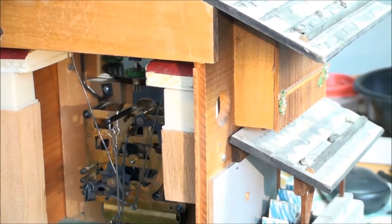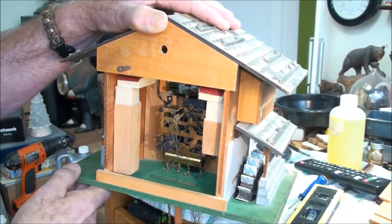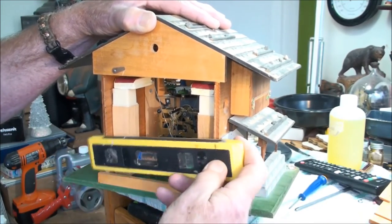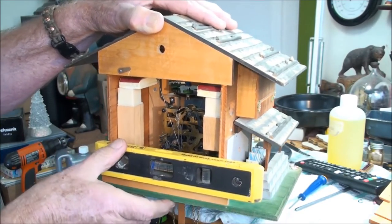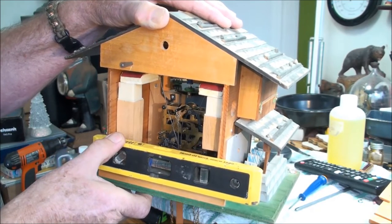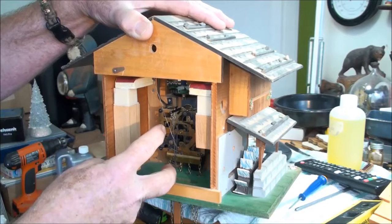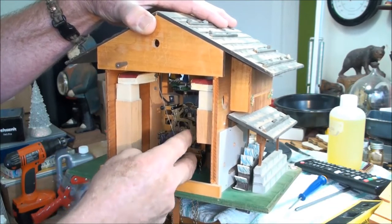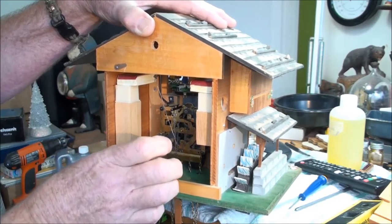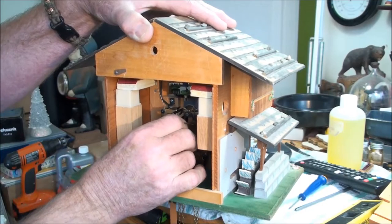You want to be able to have this clock tick — the clock's not ticking evenly; it's way off to one side. To get it to tick right, put the pendulum on. To adjust: put two fingers on the first wire — one above to protect it so it doesn't bend up inside, one below right where the loop is that the pendulum wire goes through.